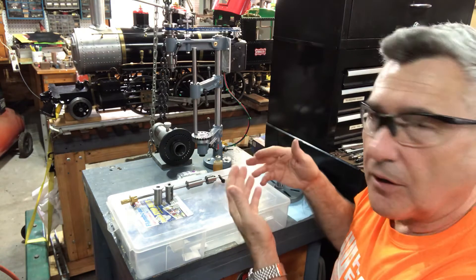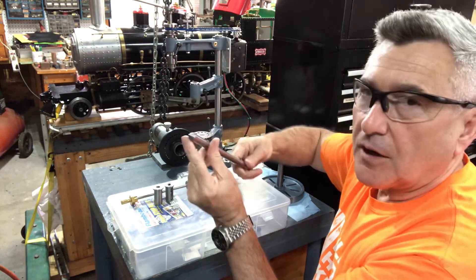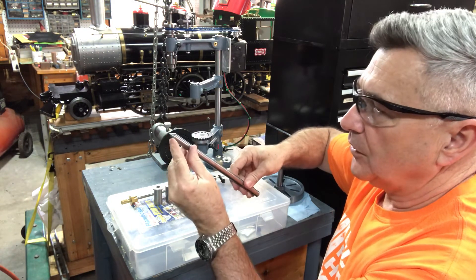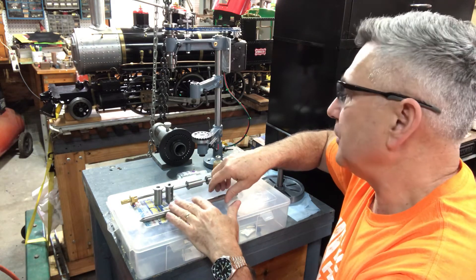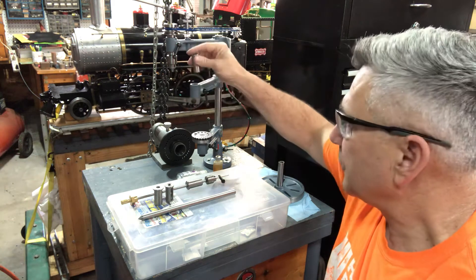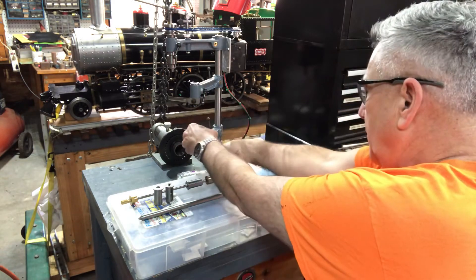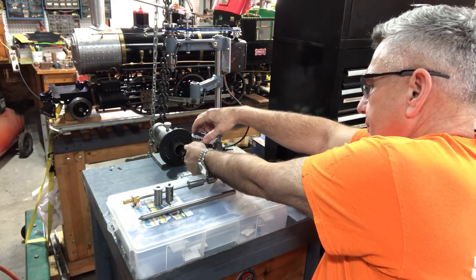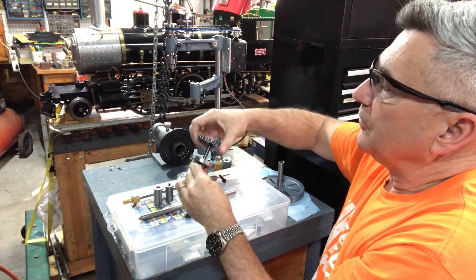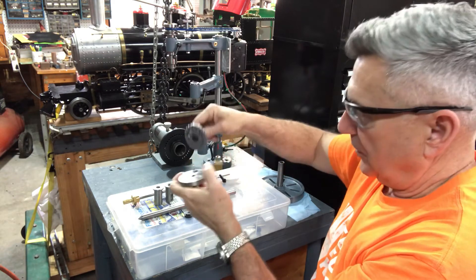What I've come up with is a hybrid design. Let me take it apart and quickly put it back together so it makes more sense. First, this is a half-inch rod — just last night I machined a 60-degree point on it on the lathe. It's not hardened yet, but I could do that eventually. The half-inch sleeve goes in the upper arm and you can lock it down.